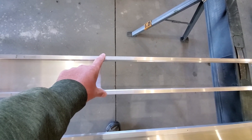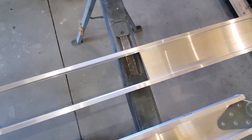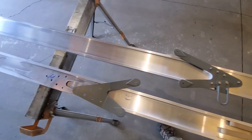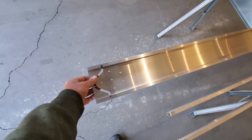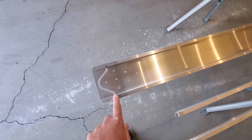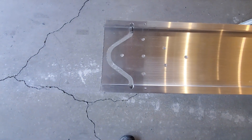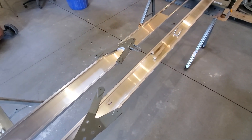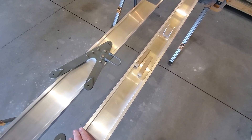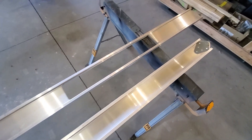You can see here this is where the wing tip starts to bend down, and this gets cut here and here. So once the wing tip is formed you'll have bends here and then these two points will meet each other in the middle. The wing spar is pretty simple — go ahead and start laying those out. One last thing: as part of the CNC process we now cut this pattern in here for you; all you have to do is finish your cut and deburr it. Take really good care of these spars — they are critical components. If this breaks in flight, highly unlikely unless you do bad craftsmanship, but if it did have an issue in flight that's not good, so do your best with them.